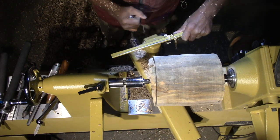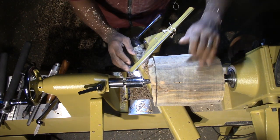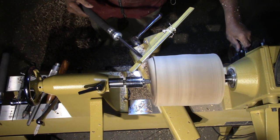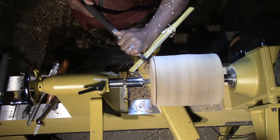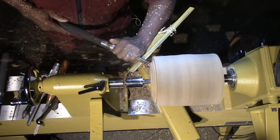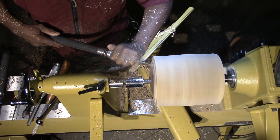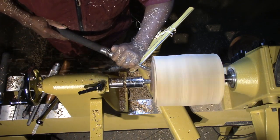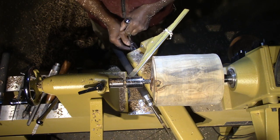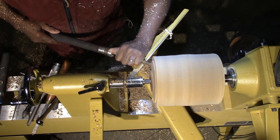Need to cut that off because it's just beating me up over there. Three-eighths inch bowl gouge, which is kind of my favorite tool for everything. It's not spindle work. When you're turning, no matter how sure you are of the piece of wood, stop occasionally, take a look and see whether the thing is about to come apart on you.